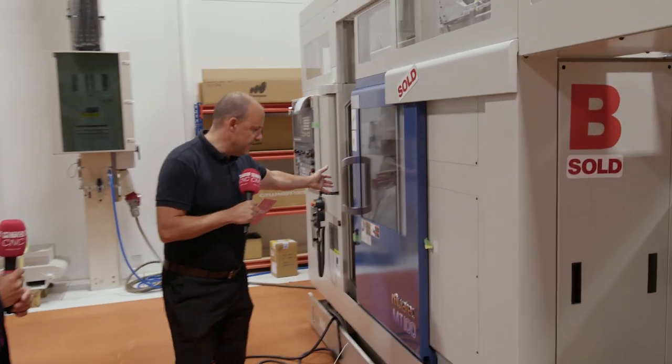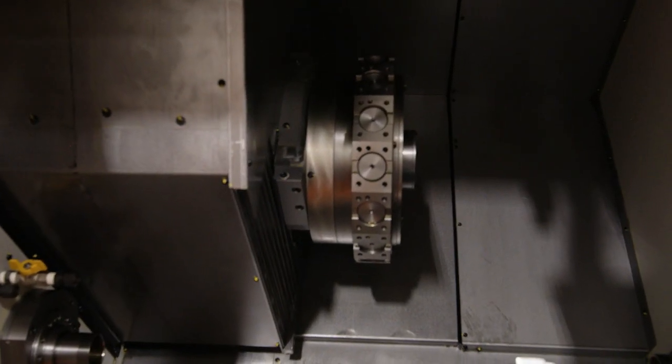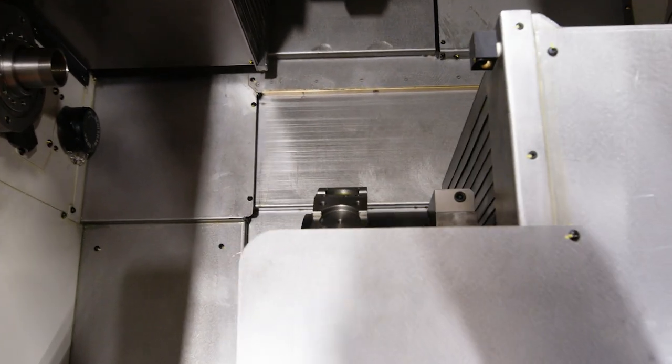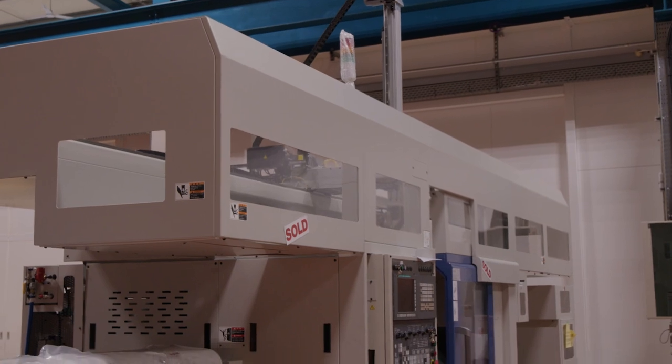Looking at an MT here — the lights aren't on but the machine is sold. It's a twin turret, twin spindle, gantry-fed machine. There are basically two different variants: the MT100 and 200i, and the MT100 and 200g. This is a 100 and 200i type design machine, which has the unloader. It's a bar-fed machine, either 65 or 80mm, with the ability to unload a shaft up to 790mm long.